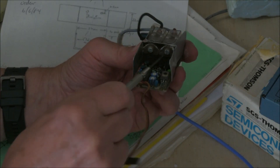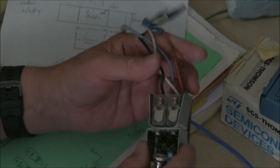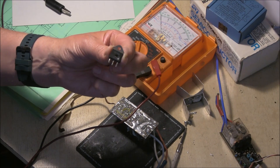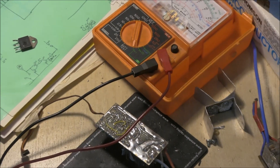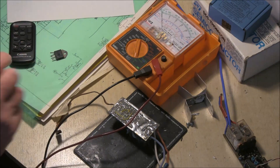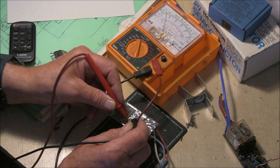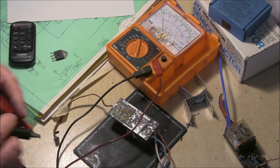To fix this I changed the power transistor and checked out everything else. I've unsoldered the blown transistor and now you can see it's got a hole blown in it — it's literally blown apart. I just use a standard analogue resistance meter and I'll check the other transistors to make sure they're not blown, and also check the diodes that could have blown out as well. They're all fine.